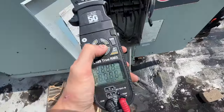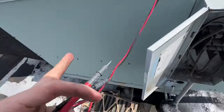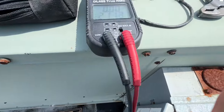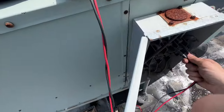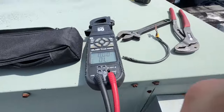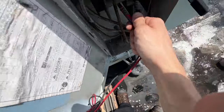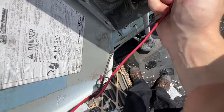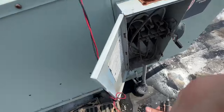Before I go crazy touching anything, let me get our meter out here and start checking for voltage. It's three phase, so we'll go from one leg to the other. This is the incoming power — we have 210. One leg to the other: 211. One leg to the last combo: 211. So we have good voltage. We didn't trip any breakers. I'm just going to check the other side — zero, 0.4, pretty much zero. Just making sure that it's safe to work on.